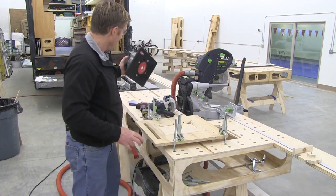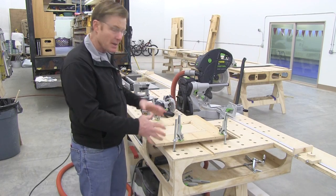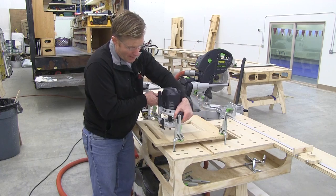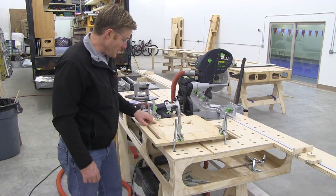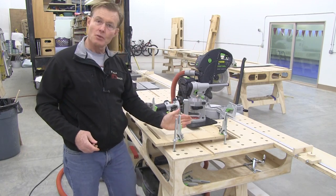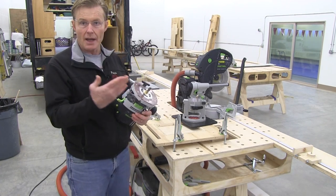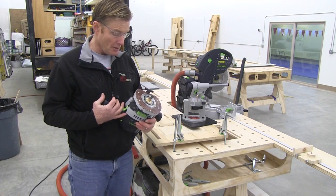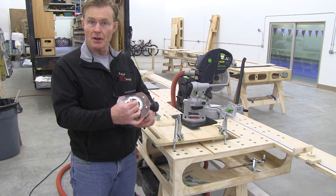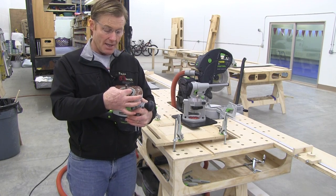The way I do this is I measure the plate and then I took a piece of scrap three-quarter plywood and made a cut in the middle of it. This piece of scrap is large enough that I can clamp it down on the material I'm going to cut and still have room for the router to ride around it without bumping into the clamps. The dimension of the cutout is the plate plus one-eighth of an inch in width and length, because I use a template guide rather than a pattern bit. Pattern bits work great — you'd make the hole the size you want and it would fit right in. But since I prefer using these upcut spiral bits — these half-inch bits — they make a really nice cut, they last a long time, and they're not that expensive.